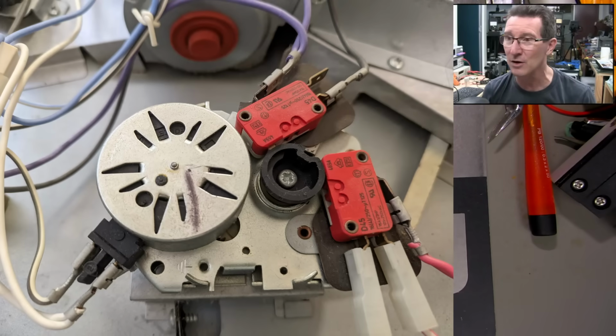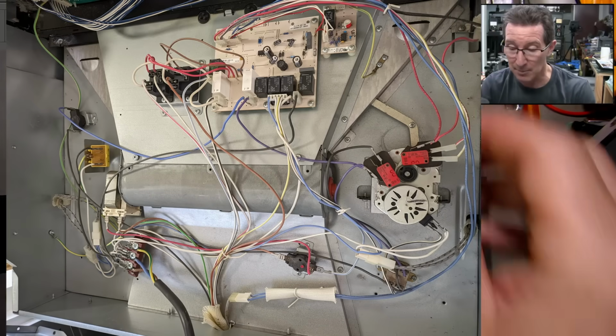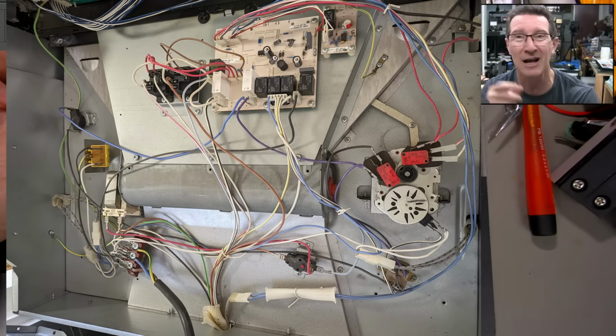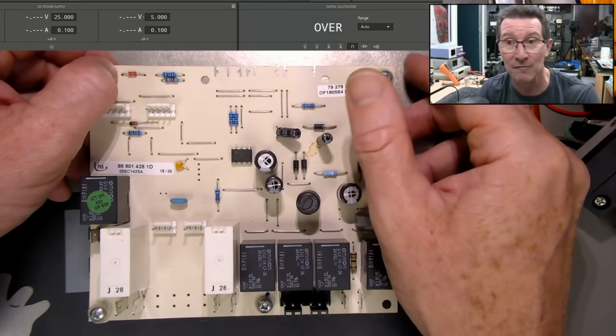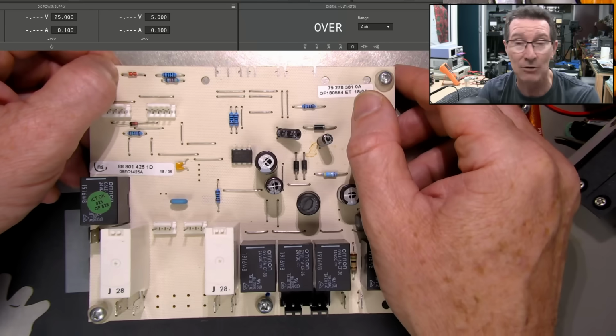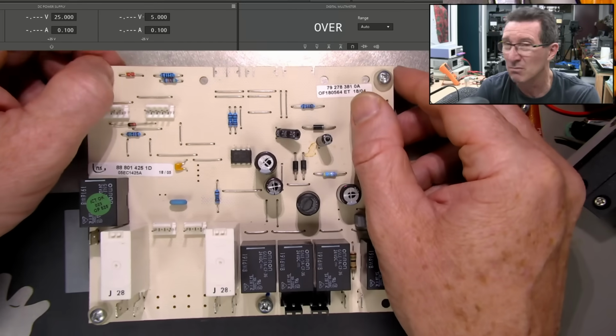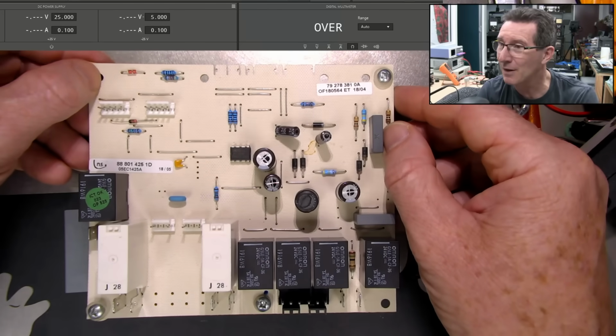I'll try and insert a photo here. And that interlock has failed, and it keeps going clunk, clunk, clunk, clunk, clunk. Yeah, it just gives an F33 after a minute of going clunk. It gives an F33 error message, and then just doesn't do anything, locks up. So yes, I've tried turning it off and on again, and that doesn't fix it.